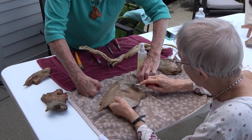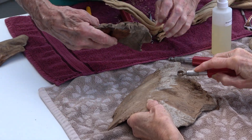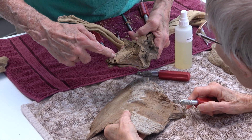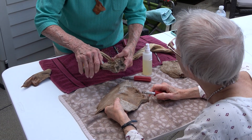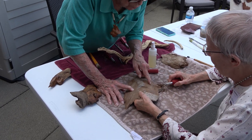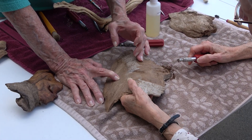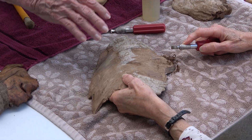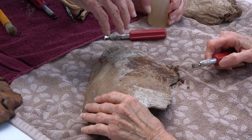Some of these pieces are pretty astounding. Look how much I had to take away to get down to the good wood. We could really use a chisel and get rid of that whole bunch there and it would look very different. But look at the little grain pattern marks you just found — isn't that nice? When we get down to the wood, if you want to do a little section there, you get down to the good wood. One way you can tell — if we squirt it again and it's opaque, you need more scraping.